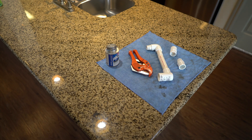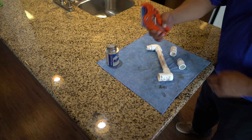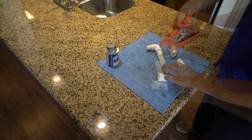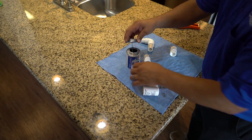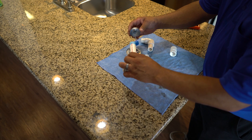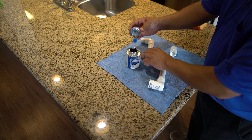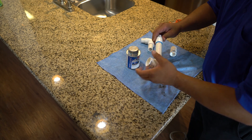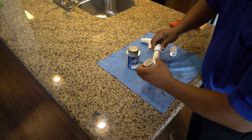After you've performed lockout tagout, you will need to install the plumbing for the float switch. Cut the three-quarter pipe in half. You'll glue the coupling in the middle, then screw each end of the coupling together so that the pipe is connected again. This coupling will make maintenance easier in the future as you will be able to turn the pipe to dump out excess water.